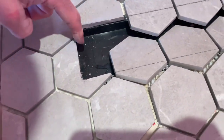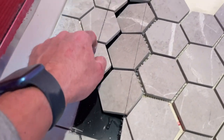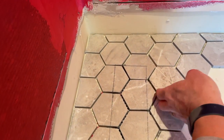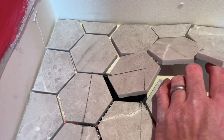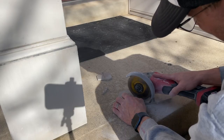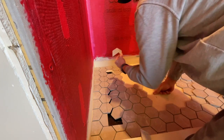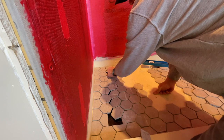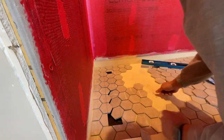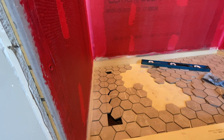The first piece is cut — I just need to clean it up a little but it looks really good. I like getting the end pieces cut first, then working on the middle. The next cut I do with a grinder outside, taking my time. I broke it twice cutting — well, broke it once and had to pop it out. Even professionals have that issue. There's a cracked tile — that's life. Now I'm going to dry-cut all of these; they look pretty good.